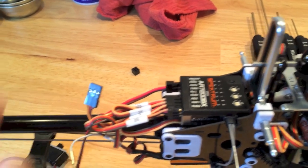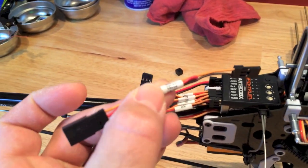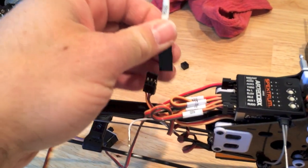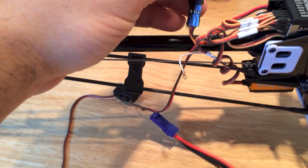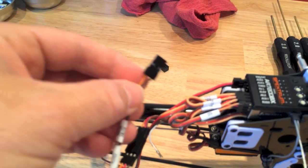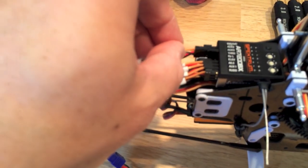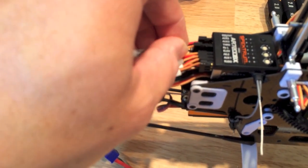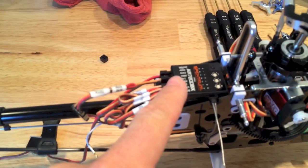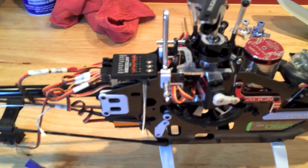The second thing we want to do is prepare this lead over here. As I indicated before, I have this little harness right here that I made. I'm going to hook this up now to the ESC lead. Keep in mind there is no power here and nothing's going to be powered up. As you can see, the red wire is pulled out and the orange wire is on the top. I'm going to plug that into the throttle channel of the AR7200. Remember, the battery is not hooked up to the ESC. There is no power that's going to be delivered out of the ESC to the AR7200. That red lead is out and the battery is disconnected from the Phoenix, from the Castle Creations ESC.